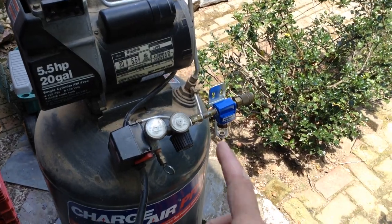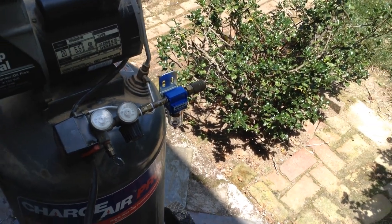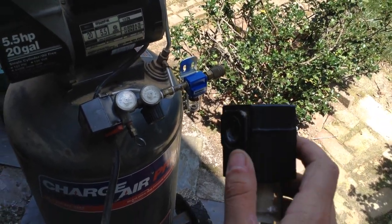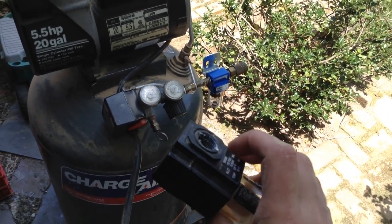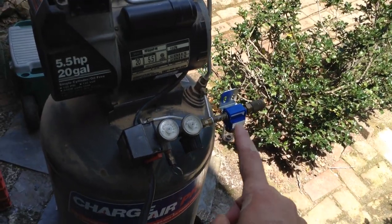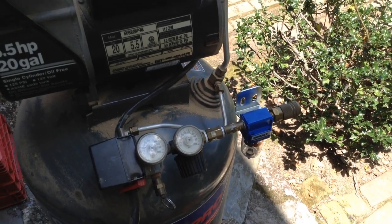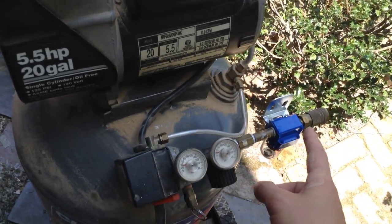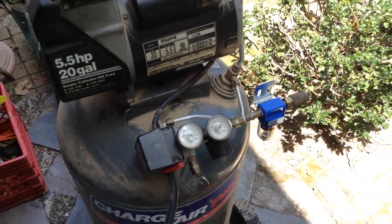This is the setup I'm left with, a new filter. I was able to remove a couple pieces of pipe because the old one, he had some fittings to step up the size of the brass fittings because these are larger holes, but these are smaller. So I was able to remove a piece. I actually could have gotten rid of this whole length, but you wouldn't be able to spin this on. It would have hit the tank. So I think that's why he had this kicked out so much.